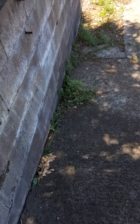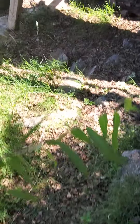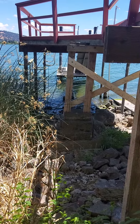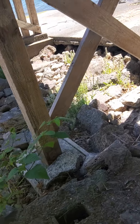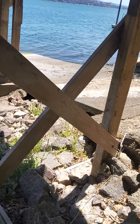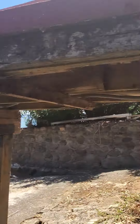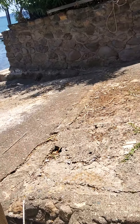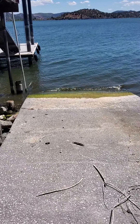I think the dock is actually in pretty good condition. I haven't seen too much moisture damage to be concerned about — it's all pressure treated. There is a little movement in one area, but you still have a girder with steel columns going down. There are some areas that should be tied. I would recommend tying another piece from here to here to secure the joint where the girder meets the two-by joist member. That'll be in the report. There was some movement, but I don't expect it to fall down.